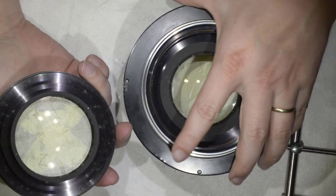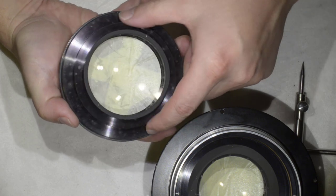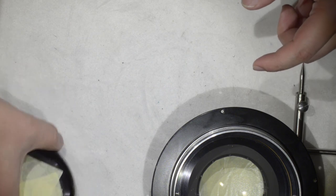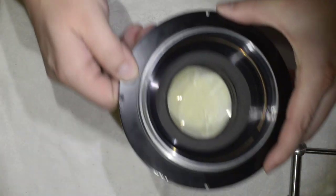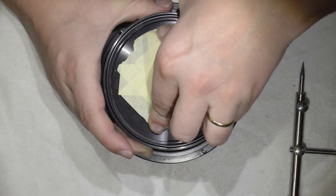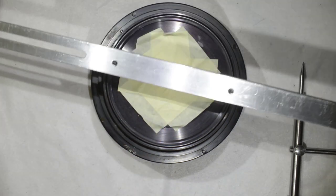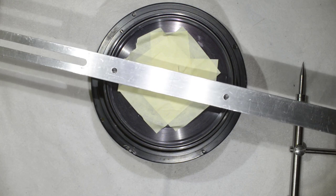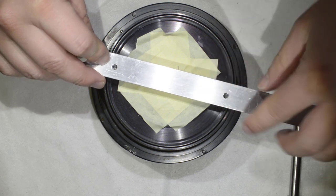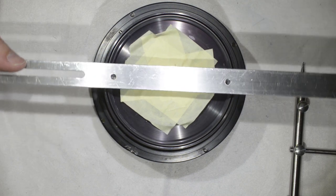Okay, so here is the first element. And then we access straight away, and then we see the fungus in the lens. Okay, so then we go to the other side. Same exercise with the big spanner. The distance between the points for the spanner is the same between the front and the back. And then this lens is symmetrical,